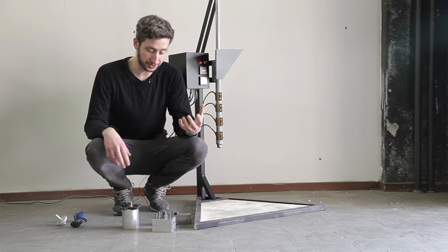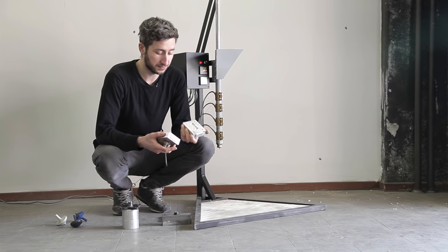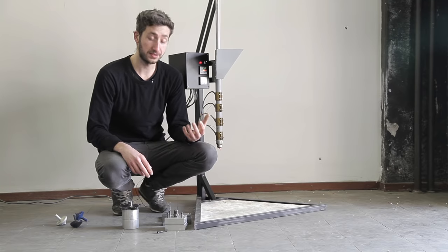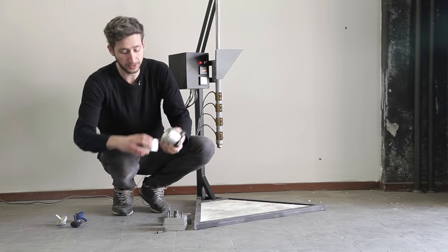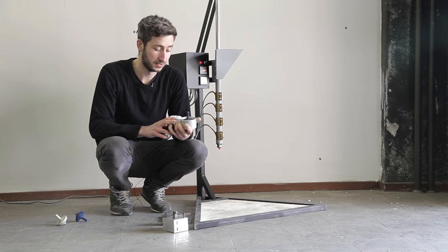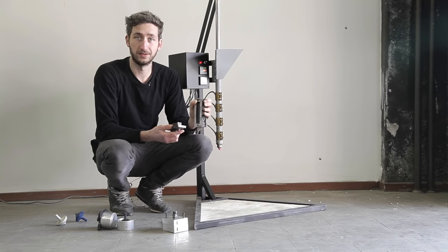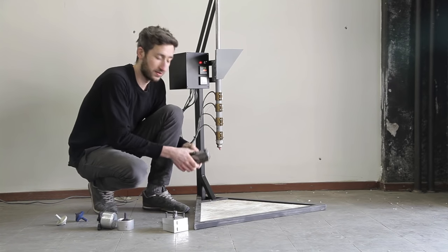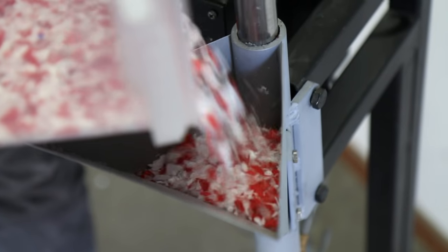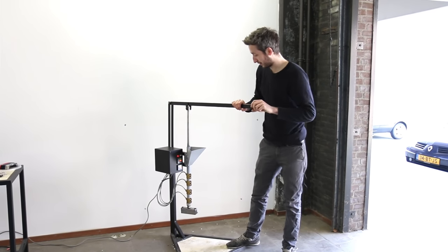Here we have the injection machine, and for this machine we have several different molds. CNC molds can be quite an expensive technique to use, so we also made one using the lathe — this is actually the technique we used to make the spinning toy mold, and it's quite easy and affordable. Or you can make them from steel and weld it all together. Let's try this one out — we're going to make a handle. You can tell when it's done when you can't press anymore; then it should be good.